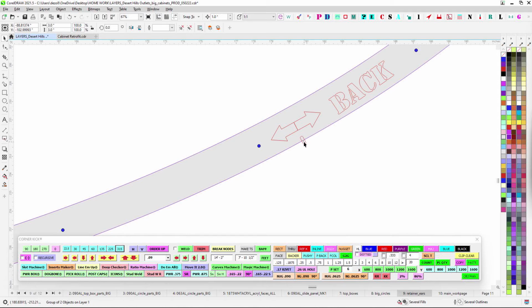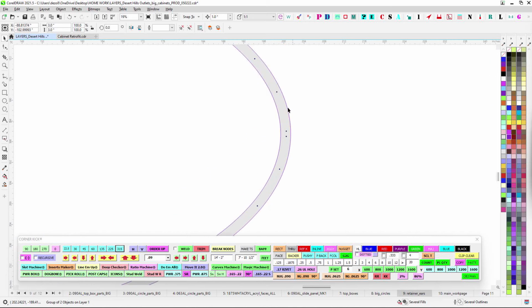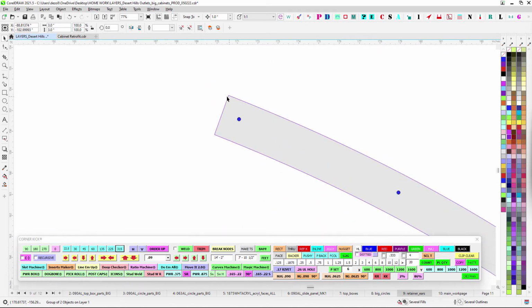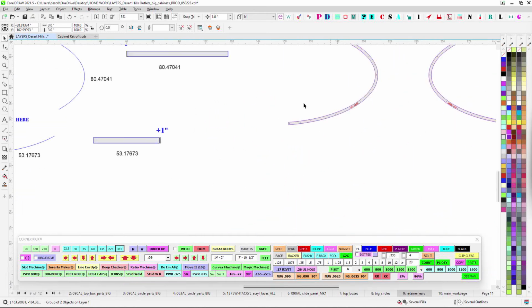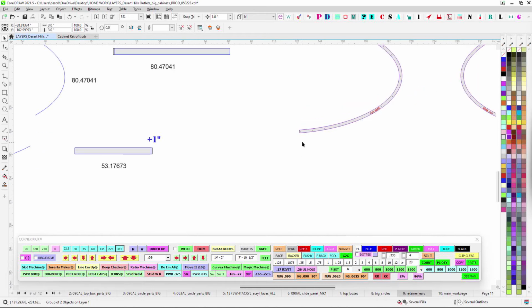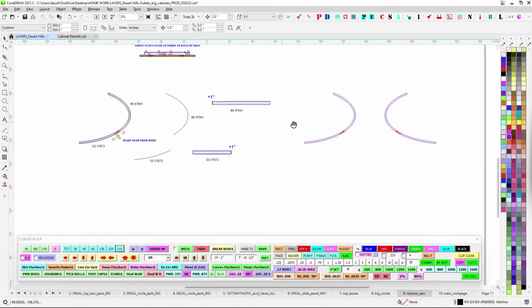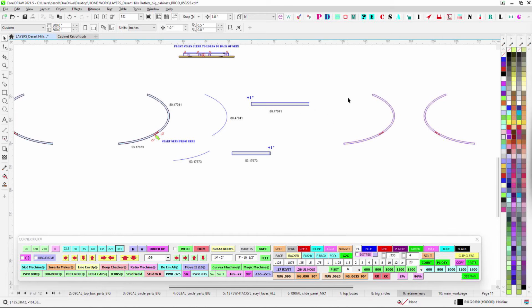So just get it in this area and go one direction, and then start going this way and work your way around and let it go long. I have 1 inch long. You're just going to square it up with this and slice it flush and make it look nice. Same thing down here. You'll have 1 inch of return sticking out, square it up, cut it off. So you'll have 4 of these, 2 per side. And I think that's a nice, elegant solution to making sure this is nice and strong.